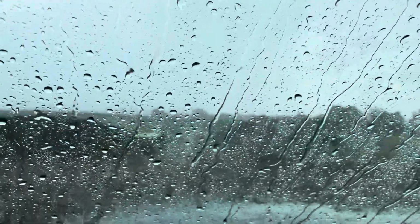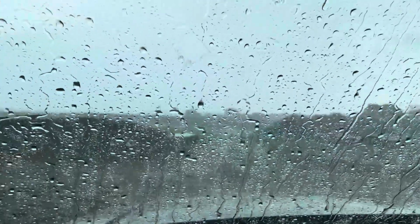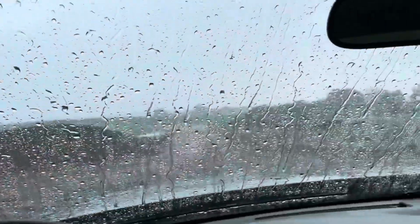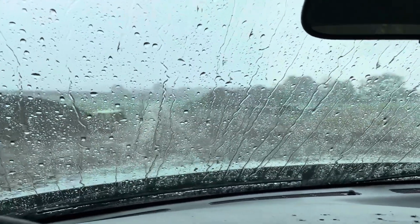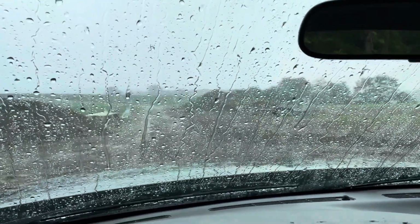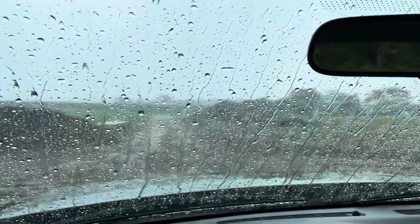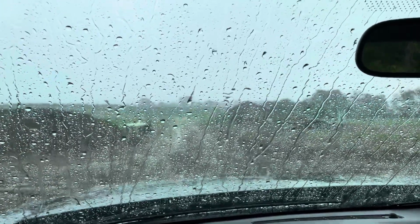Monday morning, 11 a.m. It's raining again. I'm down in the basement hand digging the outside of the footing, getting ready to install the, we call it the footer drain, which we're going to use a 4-inch corrugated perforated pipe with a sock on it. So I'll show you that later when it quits raining here. So got soaked by the time you pick up the tools and close the toolbox, but that's okay. Good for the crop. So we'll check in with you in a little bit.